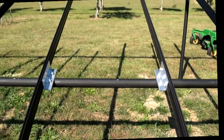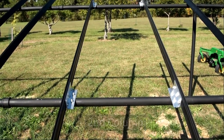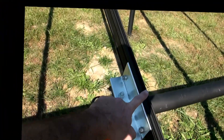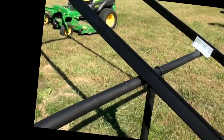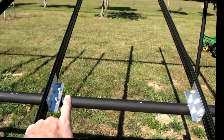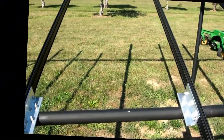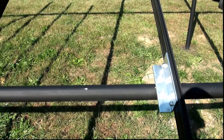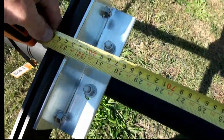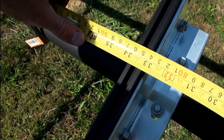For the third and fourth rail, which will hold the second row of landscape-oriented panels, we begin at 36 again. So: 36, 30, 36, and then 30 — and it should continue like that. We'll see how the spacing works out when we put a few actual panels on. The rail connector is loose and we'll slide that out to 36 inches.